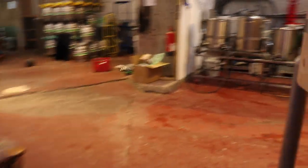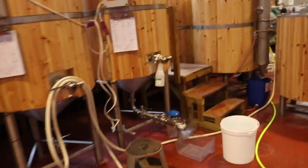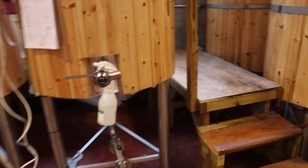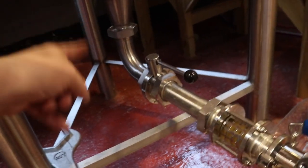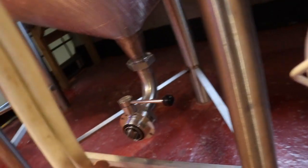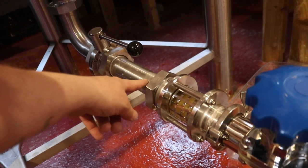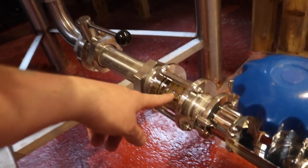Let me come across here and have a look at our yeast harvesting assembly. In fact I think I can just kill this pump for a moment — there we go, that's considerably quieter. So we'll just have a little peek at this yeast harvesting assembly and show you what's going on. We've got a 90 coming down to our valve on the tank — that's normal, that's what we have on all the tanks — and then what we've done is attach an extension, which is female to female, so we can put on this sight glass.